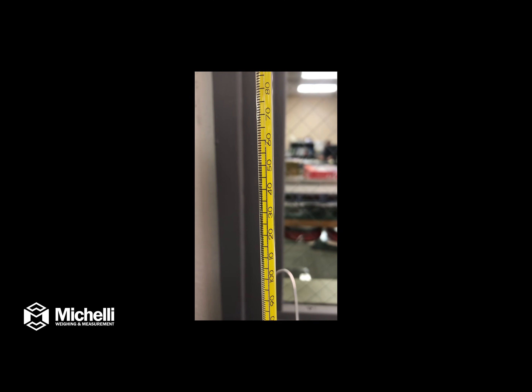When calibrating mercury thermometers, one of the things you have to look for is gaps in the mercury. As you can see here, there is a gap between the top of the mercury. There's actually two gaps. You can see one little gap dot there between — it's really hard to see that, but you can clearly see approximately a one to two degree gap between the mercury.